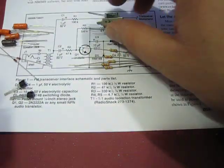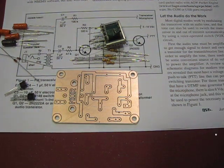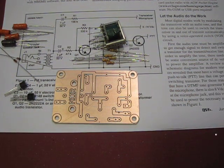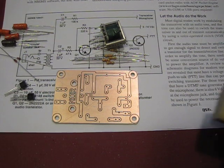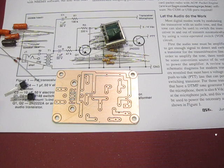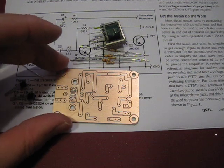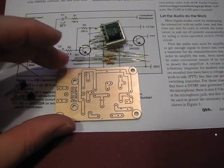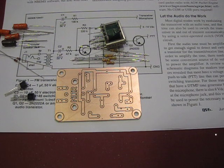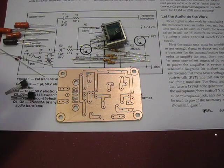You should also have a PC board. Before you do any soldering, I recommend cleaning off your PC board. You can use a 3M scrub pad that's non-conductive, or an eraser — just erase the whole board to make it nice and clean, removing any oxidization. Then clean it off with isopropyl alcohol, which makes a nice clean surface to solder onto. I would not recommend steel wool, as it leaves traces behind and could short out your board.